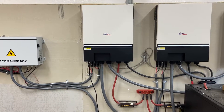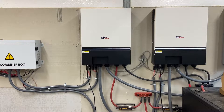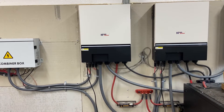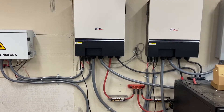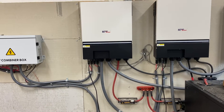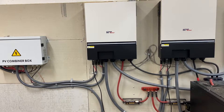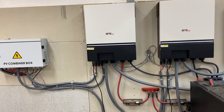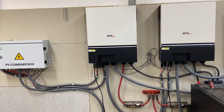It's a testament to the fact that these machines are very smart, but a more balanced panel arrangement on each inverter is really going to help. Even with smaller loads — maybe all your fridges are on one leg and a mini split on the other — it really helps when possible to balance these. This is really going to help me now as far as running the well or water heater or any of those 240-volt loads.